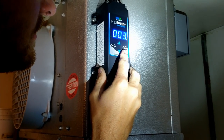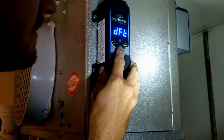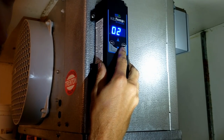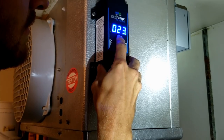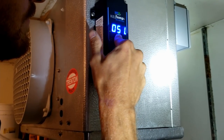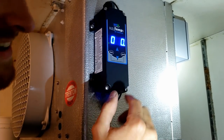Low alarm offset is 3 — that sounds about right. High alarm offset is 5, so if it goes up to 40 or so. DFT is defrost time — 20 minutes — that's pretty short. Let's take that up; we can go as high as 60 minutes. Let's just do 60 — that's the industry standard for us — and if we do fewer of them we'll be alright. Everybody's going to be a little different depending on humidity levels and where they live.